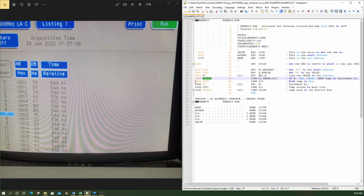So the next instruction is at 808. So if we go to 808, we see, okay, well anyway, with this logic here, it's not going to be equal. So it's compare, jump if not equal. If it's not equal, it's actually going to jump to label 2, which is 80A. So this 808, I believe, is just kind of like a prefetch. But it has the right beginning there, which is 80, but then it does jump to 80A. So 80A is an instruction that has a data of 9 in it.